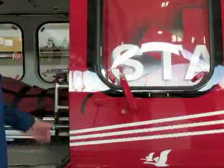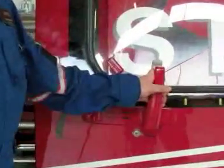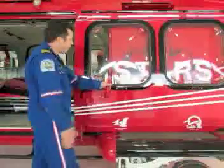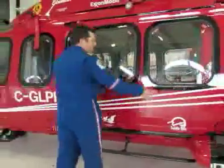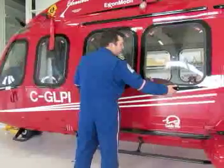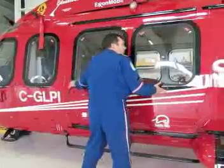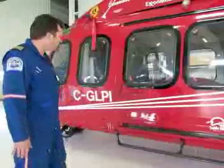To release the door and slide it forward, you'll have to move the handle to the aft position again. And again, that will retract the pins into the door frame itself. So while you're holding the handle in the aft position, you can start to move the door forward. Gently press with your other hand on the aft part of the door, and once it's in its half-seated position, push the handle forward and it locks in a closed position.